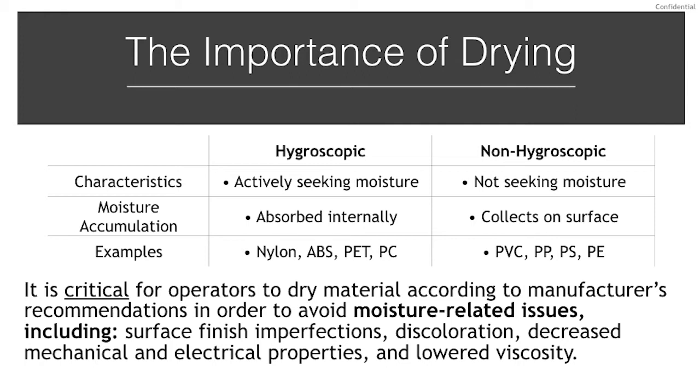For other materials, it may not be directly noticeable and leave you to believe that everything is okay. It won't be until after you begin printing that you will see a direct effect. Delamination of printed layers will be one of the most detrimental issues you will experience. For filament and FFF, manufacturers will supply vacuum-sealed packages to avoid moisture, but it's still up to the operator to make sure the material is dry before processing.